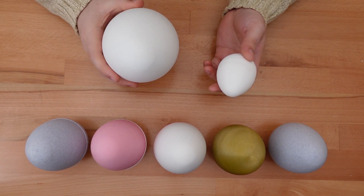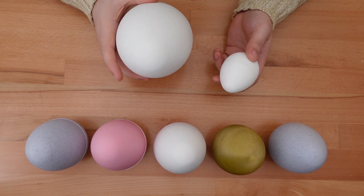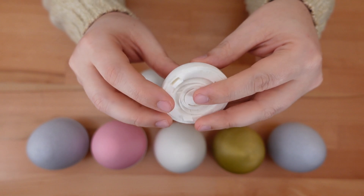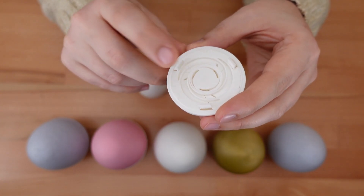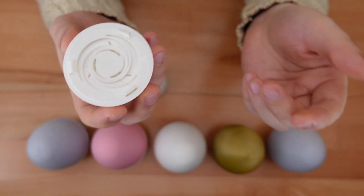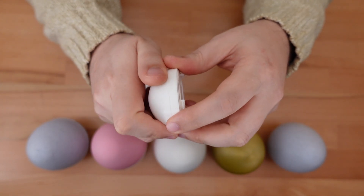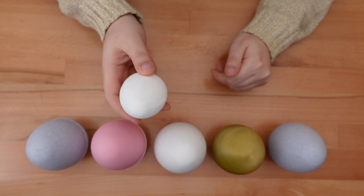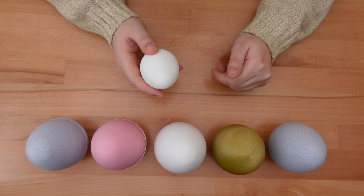This design will work both scaled up and scaled down, but keep these caveats in mind. The smaller the scale, the tighter your clearances will get, and the weaker your spring will be. Eventually the friction on the latches builds to the point that they'll only return to a locked state with deliberate force. This could be a feature if that's what you want, but it's a limitation to keep in mind.